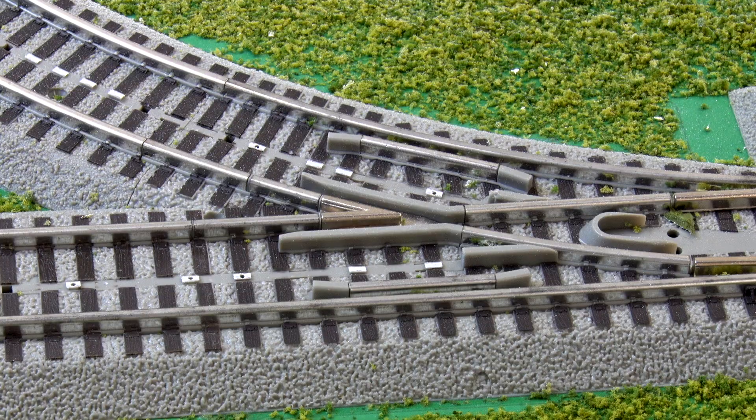This highly technical term, frog — I assume is an acronym of some sort. Not really. The thing just looked like a short-bodied amphibian, so it got called a frog. Now to continue: the switch points operate as a pair and determine on which track the train will continue to move. We either have a straight move or a diverting move possible, depending on how the switch points are aligned.